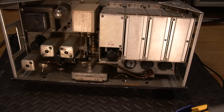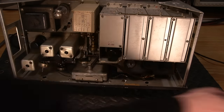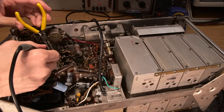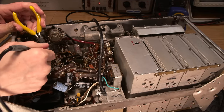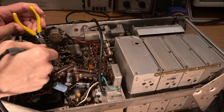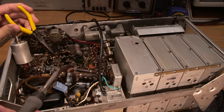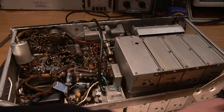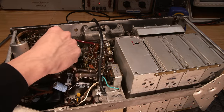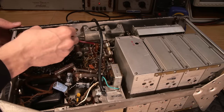And the next one is on the underside. So this wire comes out here and then goes through a little wafer board and onto the underside of the chassis here. Okay, so let's see what we got going on here. Sometimes it does help to add new solder. No, that one's, see, yeah, somebody's definitely been in here. See how easy that came off? So somebody's definitely had the face of this thing off before. So that is done. This here, and this here.